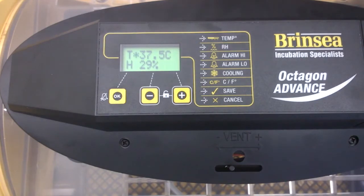What I need to do is go into the calibration menu, which is different from the main menu. We deliberately make this difficult to get into, but even then we occasionally get customers who accidentally go into the calibration menu and it does cause problems. So we do make it difficult. You need to press the OK button and the minus and the plus all down together — all three at the same time — to get access to the calibration menu.